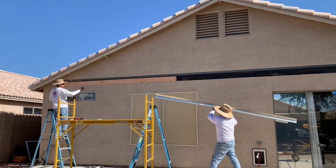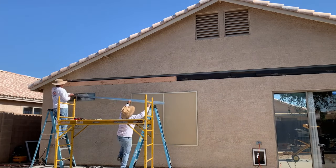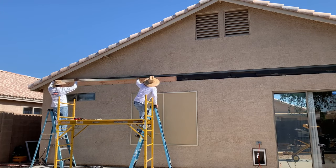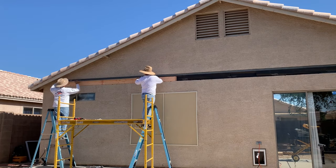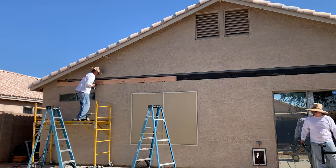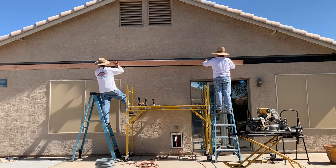Here I am carrying one of the 2 flashings used to properly waterproof the ledger board and the wall. It's hard to tell, but there is already a Z-bar flashing behind the stucco and over the black paper. This is why it's important to notch out the space for the ledger board. I really did not want to cut such a big opening, but this is the correct way to do this.